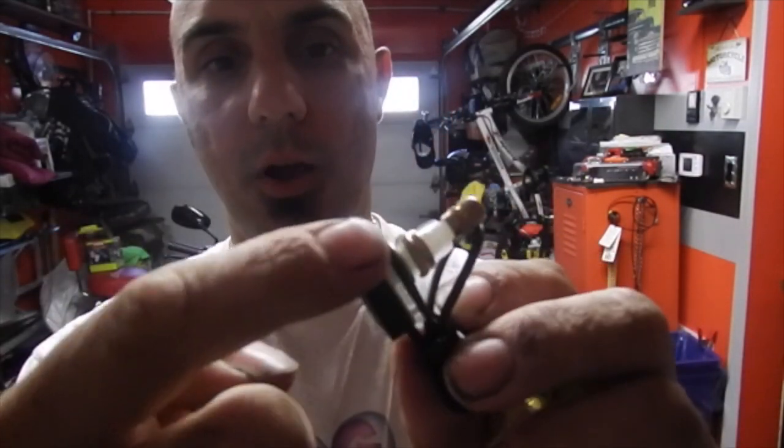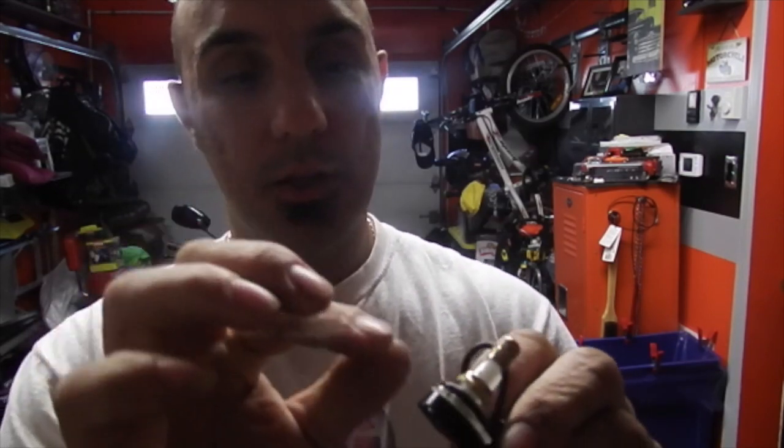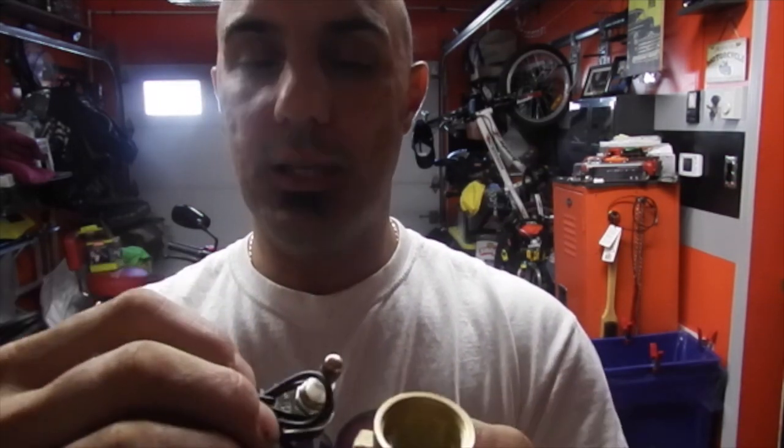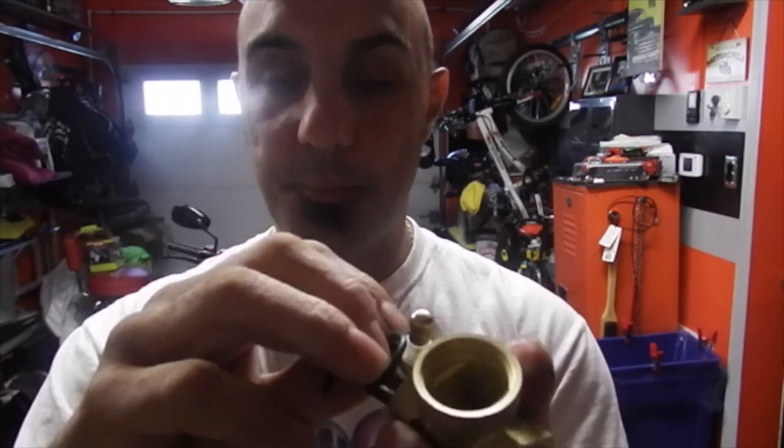And then you're gonna have to play back and forth. The plastic around here, you're gonna have to grind it out very carefully, because if you grind too much, you're gonna scrap the piece, because then you're gonna be touching the contact. And then you gotta play. You gotta try in and out, as long as you get it easily in. Once this is completely in, then you gotta glue it. The best glue is Easy Weld. It's a liquid, it's perfect. You glue it, let it sit there, and make sure it's straight for a few hours.